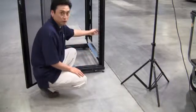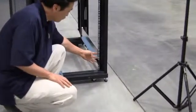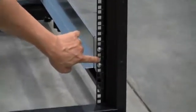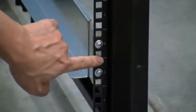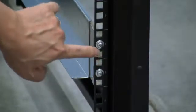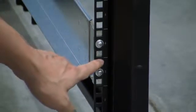When selecting which notches to use, you have to be careful and choose the right notches. You want to pick two notches, and if you'll notice, there are two notches in between the screws. Those two notches in between have a narrow or small spacing between them. In a typical rack, the pattern runs with either a small space or a large space, so the two screws go here with two empty notches in the middle — but those two empty notches must have the small space.